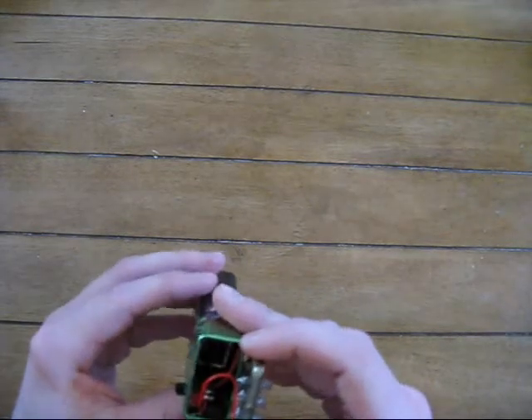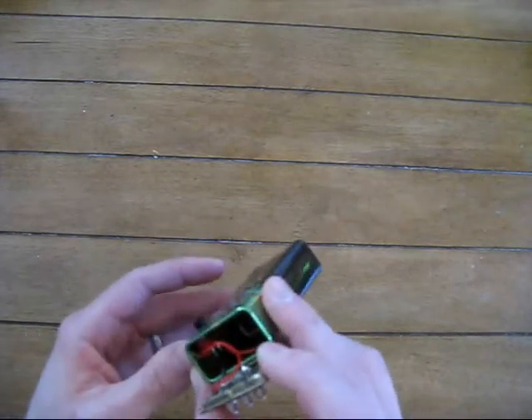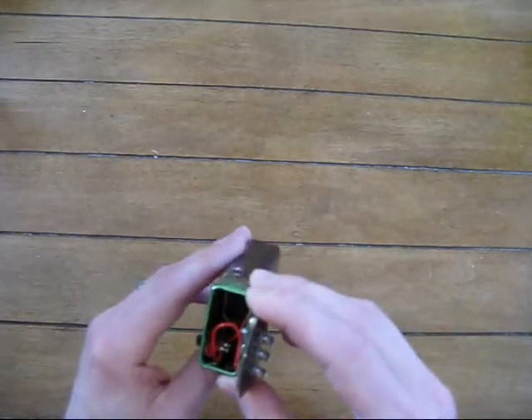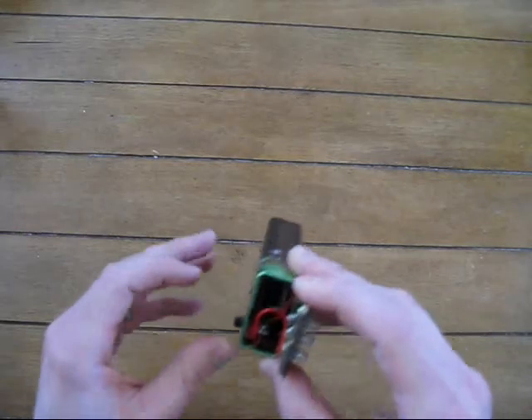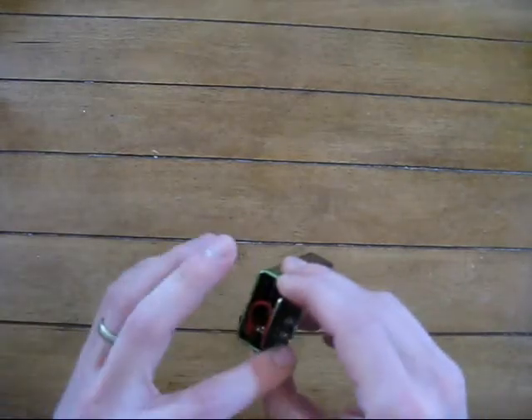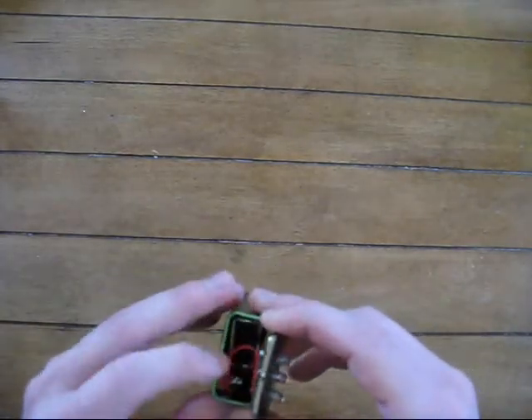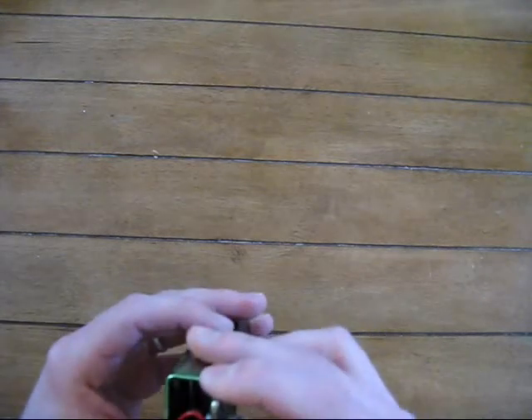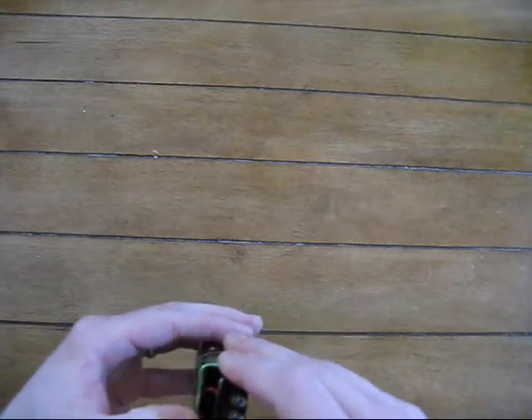So all I did, I got a nine volt down in there — you can probably see it. Hooked up to a switch and I've got a couple of resistors in there to get my voltage right for the LEDs that I chose. So it's just a simple power circuit feeding the light. It's nothing real special, but I thought if I'm going to make a flashlight, I ought to make a pretty wicked bright one.